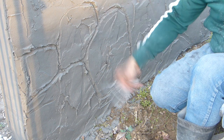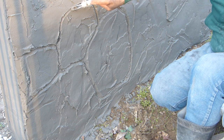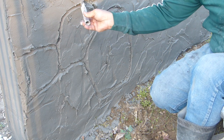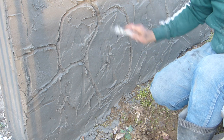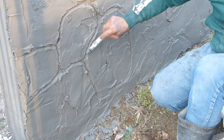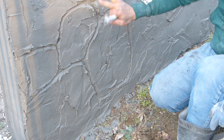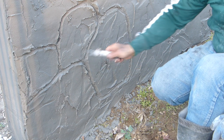I like how it's getting thicker on one side. That's almost toolable because I put this on a base layer that was kind of dry, adding a little moisture. We don't want consistency — we want some openings, some sharp edges, some dull edges. This gets white mortar — whatever color joint you want — probably more towards white to match the rest of the mortar joints. This is the veneer product with a lot of fiber in it to help hold it together and resist tension as it dries.